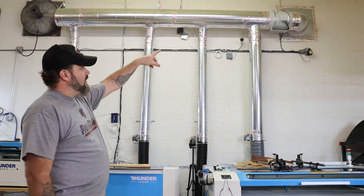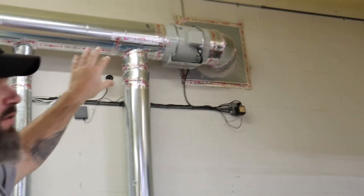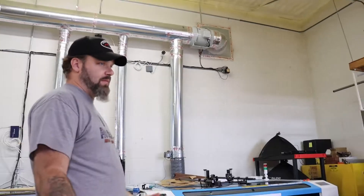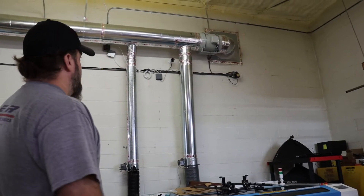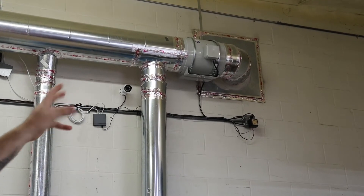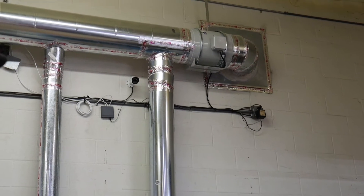Up in the upper right-hand side there, you'll see that there's a motor, and around that bend there's an actual exhaust duct, kind of like what you'd have for your dryer vent or something like that. It's got flapper valves in it that prevent backflow. Coming in from the wall, you have the fan — that's about a 1,400 CFM fan. It's on a variable resistor, so I can adjust it based on how many lasers I'm using at the time and how many ports I'm pulling air out of.